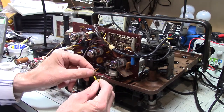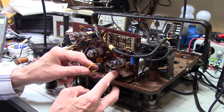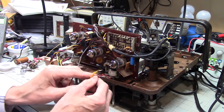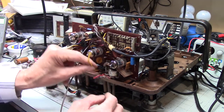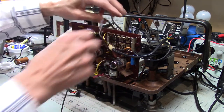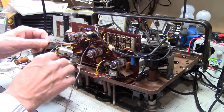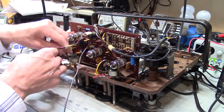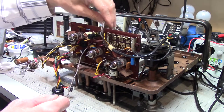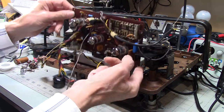Well, here's one of the fun things. This is the on-off switch here, and you've got to reach in here and solder this wire on, and then solder that wire on. But you can only do it once it's in place, because these wires are very short. But I just noticed another problem. That metal bracket that I've got to put back in here most likely isn't going to allow me, because this wire is in the way, I'm most likely not going to be able to get that together if I put this in advance. So,